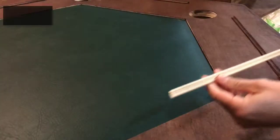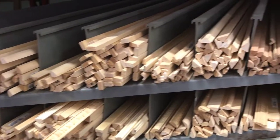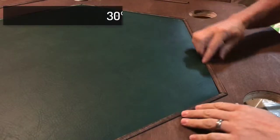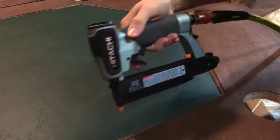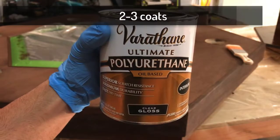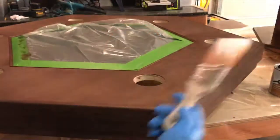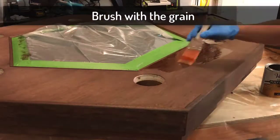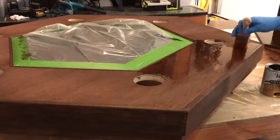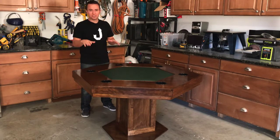There's one last thing I'm going to do before I put the clear coat on. I have these little trim pieces — they're really small, about a quarter inch thick. You can find these on the shelf at your home improvement store. I stained them at the same time I stained everything else. Remember: 30-degree cuts, pack them down with some pin nails, and you're ready to go. Do not use a foam brush — use a good bristle brush.